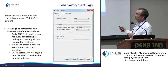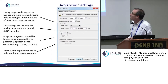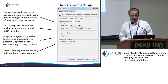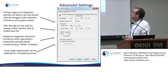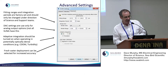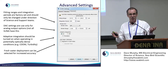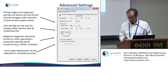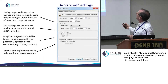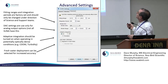There's also an SDI-12 address setting if you use that system. For advanced settings, I suggest that unless you consider yourself an expert user, you accept the defaults. Changing these makes it harder for customer support to help you, and many processing algorithms are keyed to a specific section of the spectrum — changing the range will affect algorithm performance.